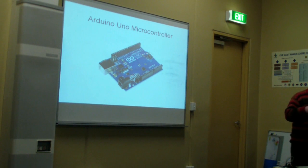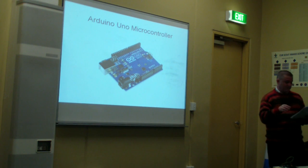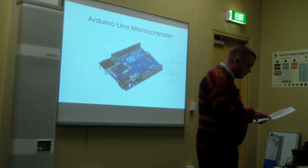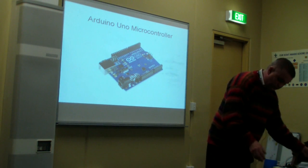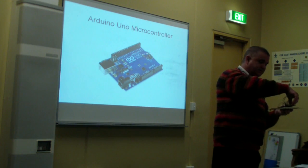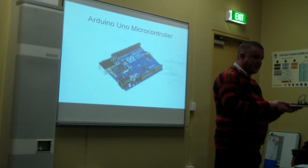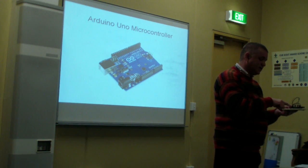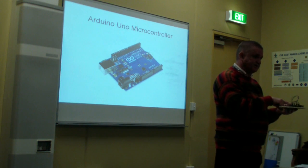So what I mean is that there's a much smaller, lighter Arduino called the Arduino Pro Mini, which does the same things the Uno does, but it's tiny. It will run the same code as the Uno. So the way one puts together a project like this is to first test and prototype using the Arduino Uno. And here is exactly what I'm talking about. There's an Arduino Uno, there's an AD9850 direct digital synthesizer, and there's a u-blox GPS.